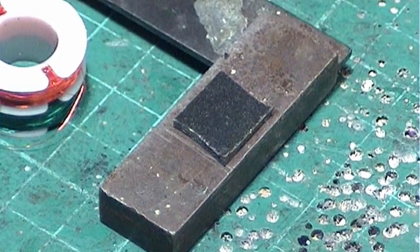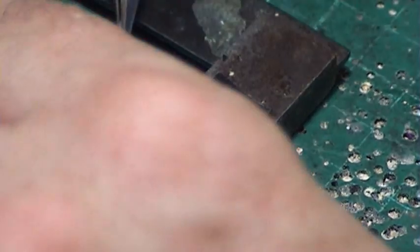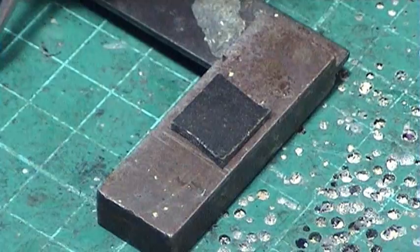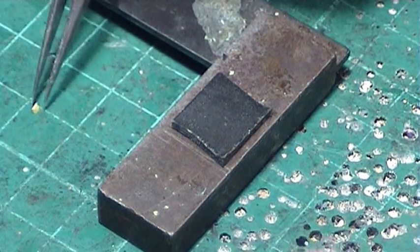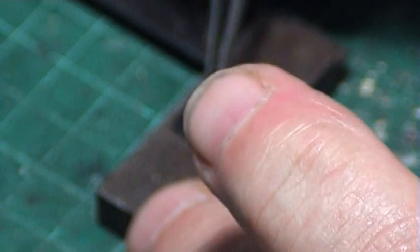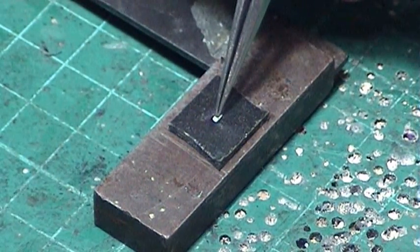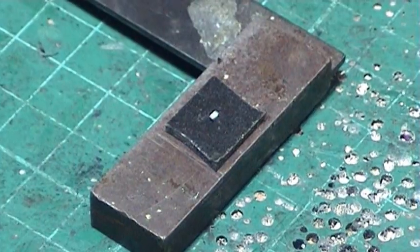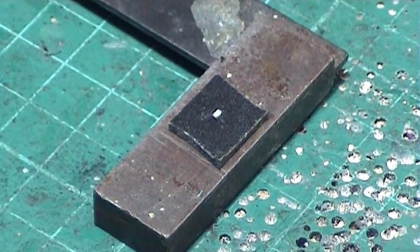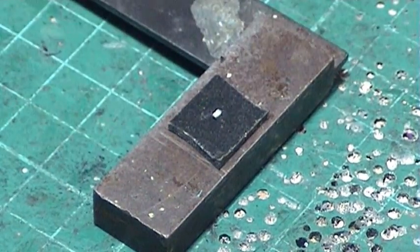This little clinic will show you how to use surface mounts in a couple of different ways. We take our surface mount LED from the packet and, using a fine pair of tweezers, put it onto some double-sided sticky tape on something heavy, taped to the bench so it stays in place. There's our surface mount 0603 LED — we're going to solder to that with enamel wire.